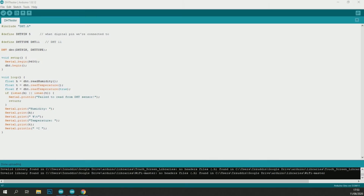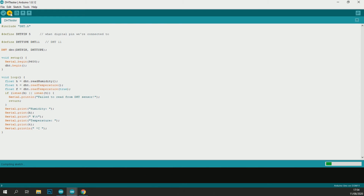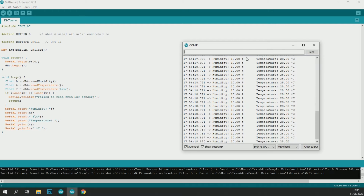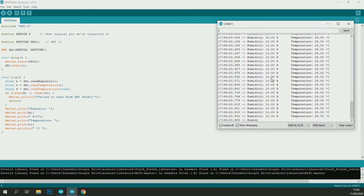Now that the sensor is connected, let's test it first. Open the Arduino IDE and upload this sketch, which reads the DHT11 sensor at pin 5. You can copy the entire code from my website miliohm.com — link in the description. After upload is complete, open the serial monitor. The data is shown on the serial monitor, which means the sensor is working.